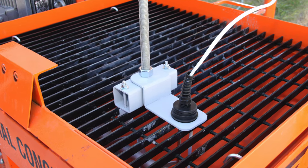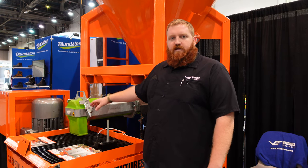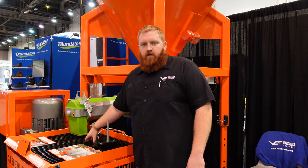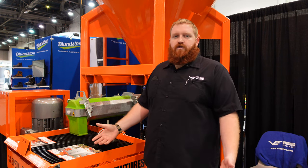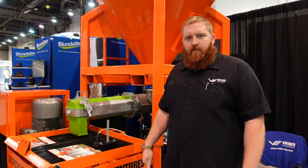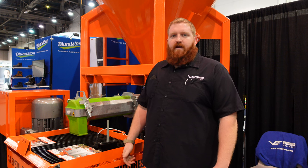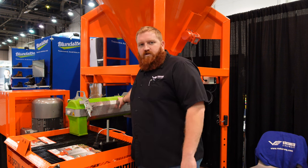This level sensor turns the mixer on and off based on the hopper fill level. One of the biggest benefits of a continuous mixer is you only mix what you need to pump at the time. With a batch mixer, you have to make one large batch — most batch mixers have a minimum and maximum volume, and if you don't meet the minimum, you won't get a good mix.